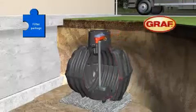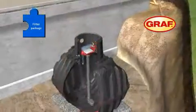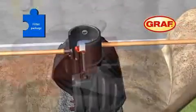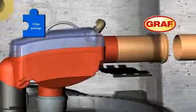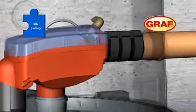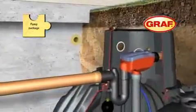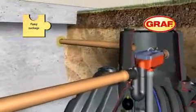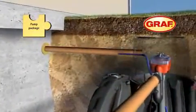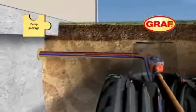The whole unit can now be installed. Then connect all downpipes from the roof and the overflow pipe to the available discharge option. The speedy push-in fitting systems and patented quick connection collar remove the need for additional tools. To complete the installation of the tank, a pipe connecting the tank and the house is fitted, used as the conduit for the floating rainwater suction hose, the supply hose for the OptiClean unit, and the water height measuring sensor cable.